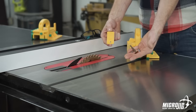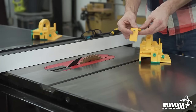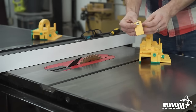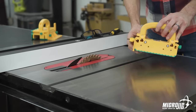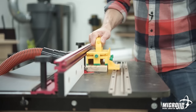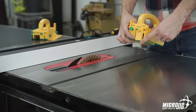Also included with the handle bridge kit is a trailing hook and its mounting hardware. You can attach the trailing hook into the same T-slot the center leg sits in — using the T-bolt, attach the trailing hook, slide your washer over, and then the wing nut. The trailing hook sits a little bit lower than the legs because it acts as a heel to help push your material through the cut. Whether you're using a router bit that takes out a lot of material, the trailing hook just helps move the material along through the cut.